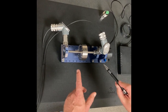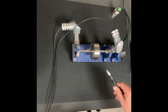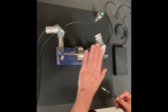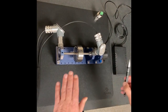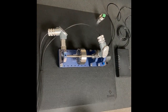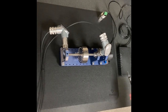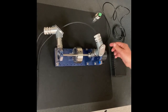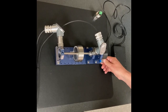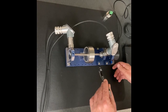There are actually just 2 connected right now, one in the vertical direction and the other one in the horizontal direction. This is channel number 1, this is channel number 2, and they are located on the bearing housing of the CMCP-601M, which is our mini rotor kit, which is a battery operated one. And I can just power this one up and create some vibration with the imbalance on the wheel.